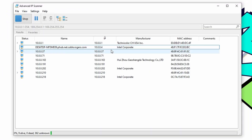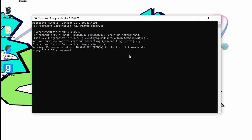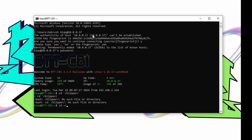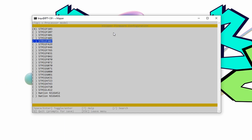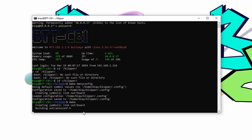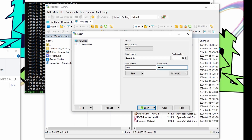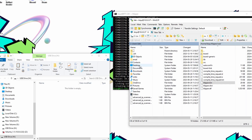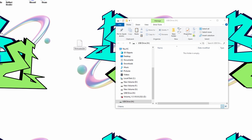Find the device on your network and confirm that you have the right IP before SSH-ing into the machine. Move to the Klipper folder, enter the make menu config command, and configure it to meet your board's requirements. Then run a make command to flash to the board. You'll then want to run WinSCP, go in, find the Klipper.bin folder, pull it off of your machine, rename it to firmware.bin, and put it onto the 128MB SD card.